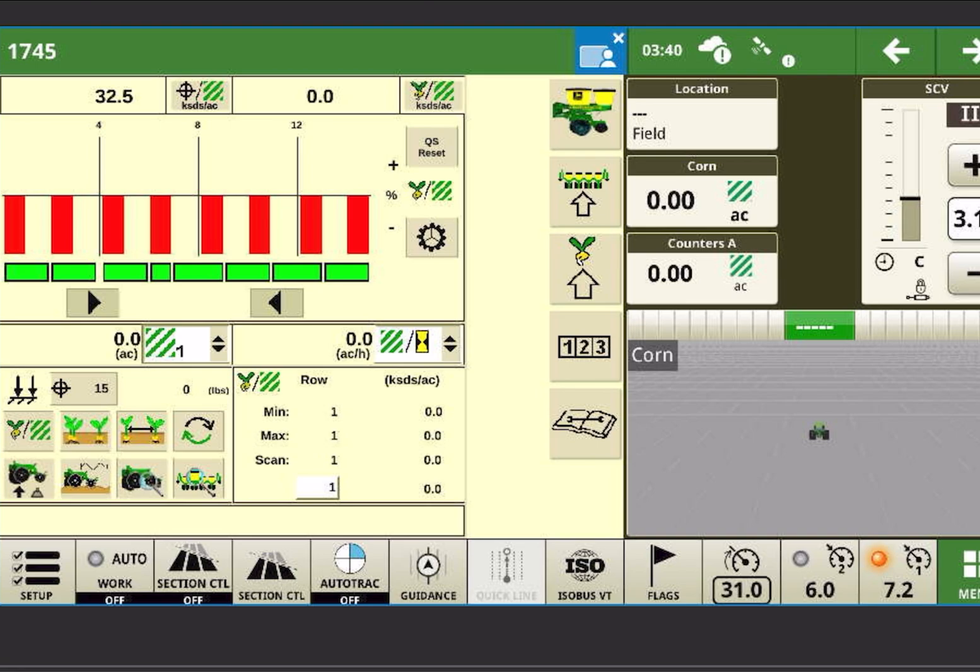Whenever you're setting up those clutch sections, it's important to remember this planner only has one drive section. But if you have a 1790 or 1795, you cannot have a row section or clutch section cross over the center line of the planner. You're going to have a drive shaft for your variable rate drives, with so many rows associated with the left and so many rows associated with the right — you cannot have a section cross over that center line or else it also will not map properly. So you need to keep so many rows to the center. That often means when setting up a 1790 that's a 12-row, 23-row, row 11 will often be all on its own as one of your corn rows.